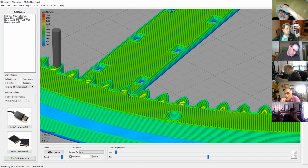To me, those are the two main things that I've hit in the past. One is heat creep because of some weird electrical connection, or even the connector that goes to the nozzle, so the nozzle cools down. The software is not great at detecting that sometimes, so the nozzle can cool down a little bit, and then it can cause a bit of a block. And then what happens is the extruder gear wears through the filament a little bit, so it can't restart again when it hits the heat.